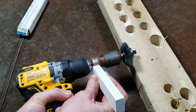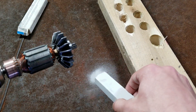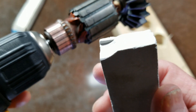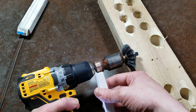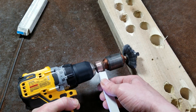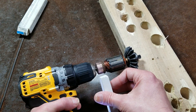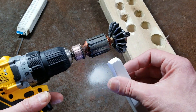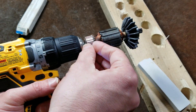These are so soft and delicate. This is a copper commutator and it was grinding it away like it was made out of wood. We can see it was not quite wide enough — that's one of the issues with getting too wide of a stick. We almost got it perfect; let me just touch it up and get rid of this little nub at the same time. This really is far too large a stick for a motor of this size. One trick is to go back and forth at a pretty even pace so you get a little bit of angle on the scratches — you don't just want it sitting there in one spot.